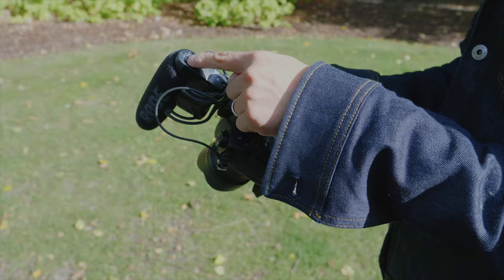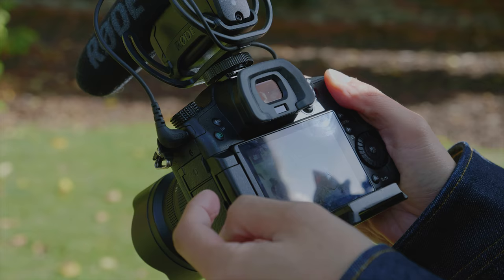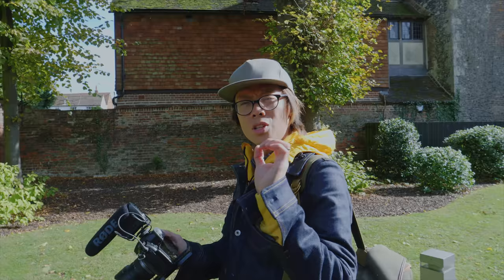You've got a switch here — on, off — and to stop all the humming. The plus 20 is great if the in-camera amplifier is not really good. Put it up to plus 20 so you don't have to push up the gain in the camera for top quality sound. So yes, this is top quality sound.